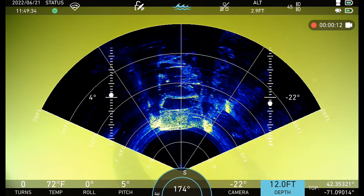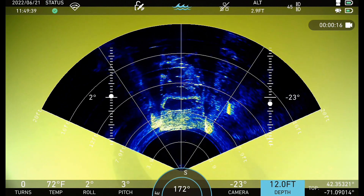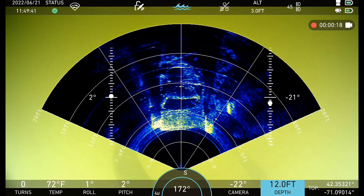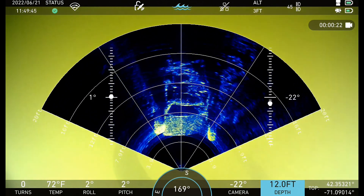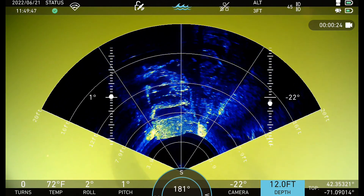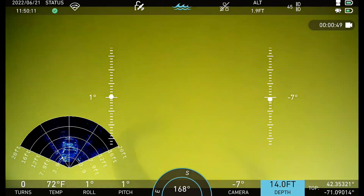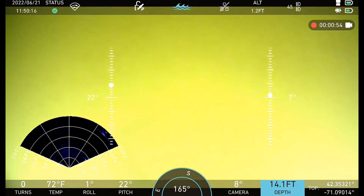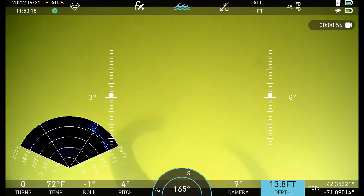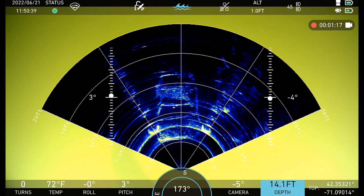As you can see, we've got our lower frequency mode on our sonar — this is at 1.2 megahertz — getting a good view of the situational awareness. We have the vehicle wedged between these two pilings, and I'm trying to figure out the best way to get to the driver's side and see if anyone might be in that car. You can see one of the challenges: it's a very high current situation and very low visibility. We can barely see the end of our grabber, so I'll be using sonar most of the time.